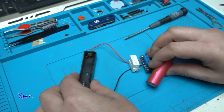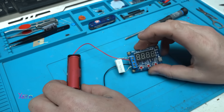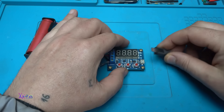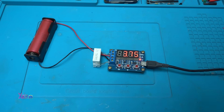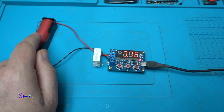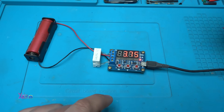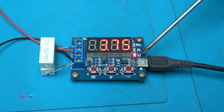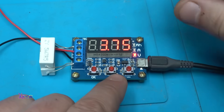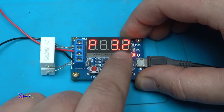I need to put the battery — I forgot. This battery is 3.7 volts I think. Nothing happens; I need to plug in power, Micro-USB 5 volts. Right now it shows the battery voltage of this 18650 lithium battery: it's 3.75 volts. Right here it is marked with V for volts, A for amperes, and Ah for ampere-hours. First we are going to set the cutoff voltage, and that will be 3.2 volts.